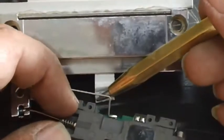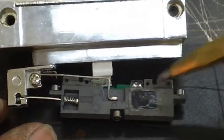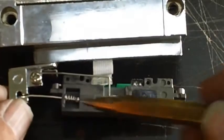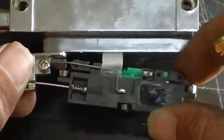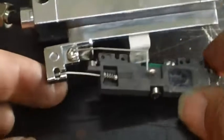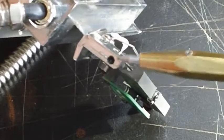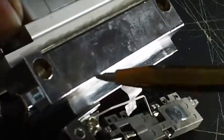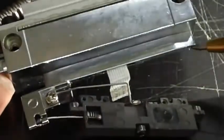If we flip it over, you can see this spring right here puts tension on the reader head — it's attached with a screw and pushes it in one direction up against the roller bearing so it's always the same distance. And this right here is kind of a shock absorber to allow it to expand and contract and rotate back and forth so it floats along the glass. This is actually put inside here and attached with a very tiny set screw on the backside. So we need to figure out how to realign this, straighten it out, reattach it, and then replace the piece of metal on the front so it can't pop out of the track again.